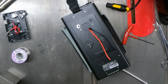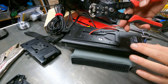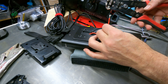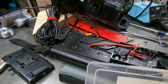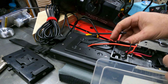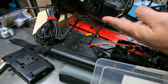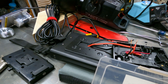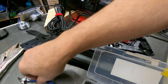Fair warning: you might need a fairly large soldering iron — up in the 75 to 100 watt range — to get these wires off the plates. The one I've got is rated at about 35 watts. Since I had no special connector inside to deal with, I just stripped the ends off clean, knowing I was going to solder them up to the new battery plate. With the ends stripped, I put some heat shrink tubing on — of course you want to put the tubing on before you solder everything together. It's really important to use heat shrink tubing because the current involved means you definitely do not want to short out the battery — it's basically a mini arc welder, so cover your connections.